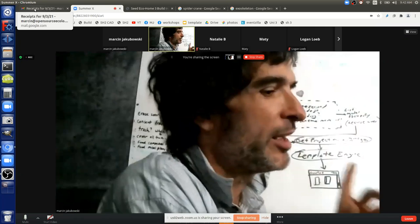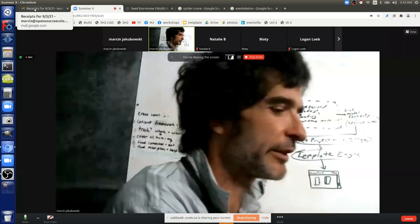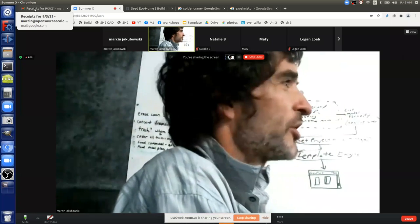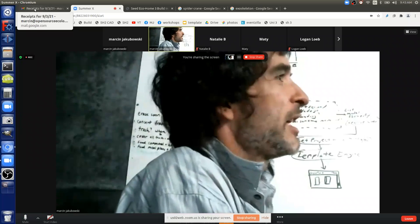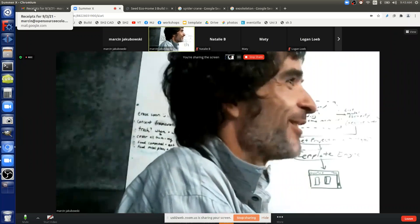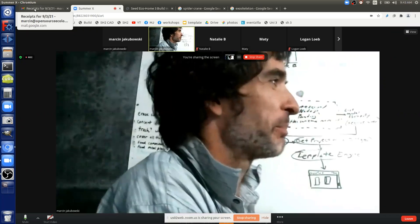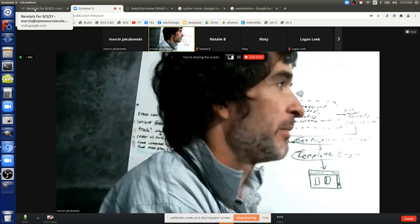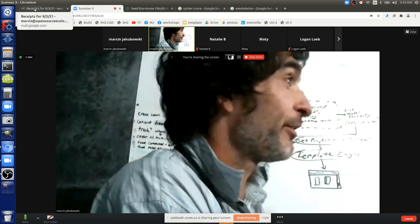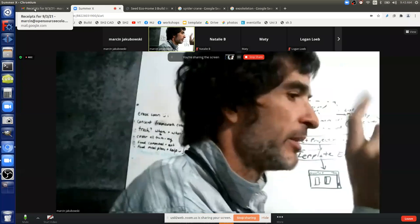So what we did the other day, we've got a bunch of unlevelness on the foundation right now, about 1.5 inches off from one end to the next. So what I would suggest, and it's a proposition, is that we move south, because we can, to 16 feet south on a pad which is actually very level, the second pad we poured. We did a much better job, and the truck didn't ram into our foundations. So we're pretty level there. What I would suggest is just removing the forms and redoing the square now.